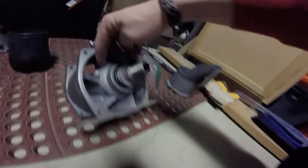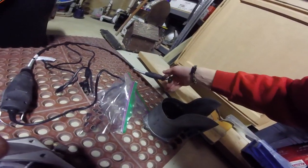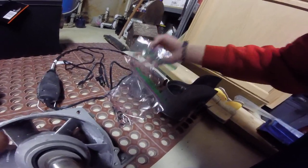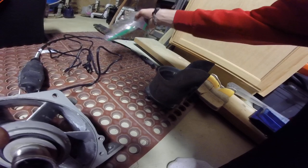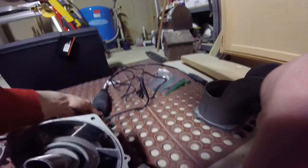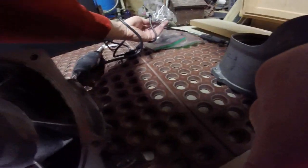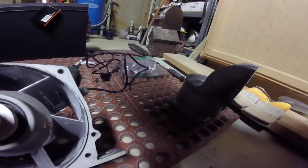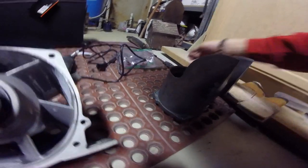All in here were casting marks — big casting marks all on the outside — it's all been taken down. The tool I used to do all that work was this Dremel with a skinny attachment. I used sanding drums of different sizes. I did go through all of my Dremel brand drums, so I bought a value pack online that wasn't Dremel brand. Just do yourself a favor — spend the extra money on the Dremel brand, because these ones just didn't hold up well. They're cheaper, but the Dremel brand is well worth it for the quality. You don't burn through them as quick. Just get the Dremel brand. That's what I used.